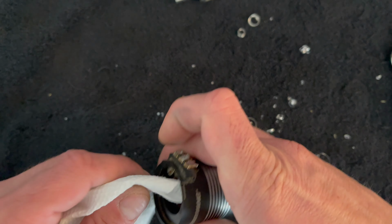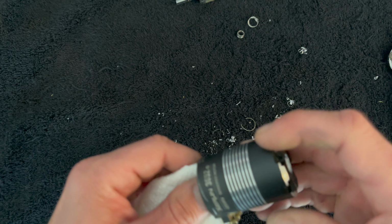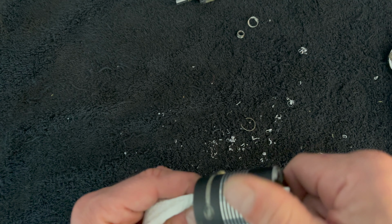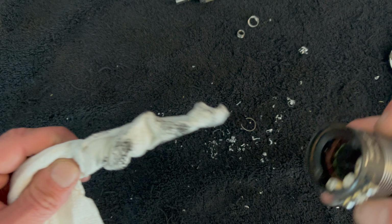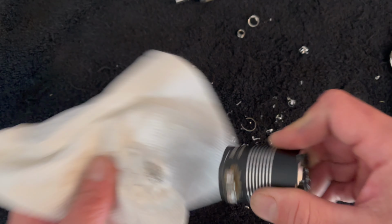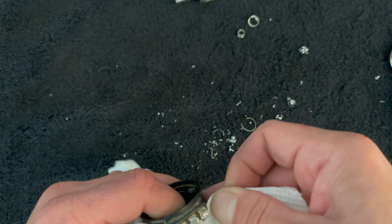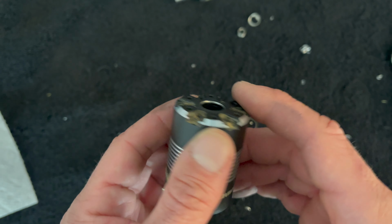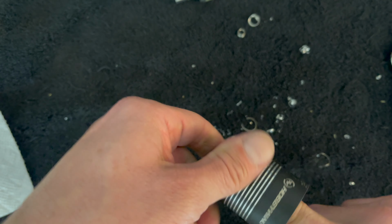Before we get into any of that though, we're gonna clean this motor out. It's full of dirt. This thing was in one of the 4x4 short courses from the Peacock pit, Ethan's truck actually, and something got into the gear, smoked the bearing, and we replaced the motor. So I always kind of salvage this guy so that we have another backup motor for the crew. And I think it's always good that if you can fix something instead of replacing it, you might as well try. And while this is not an ideal situation, like I said, the engineers always tell me the bearings are not replaceable, and I have a very good appreciation for why they say that.